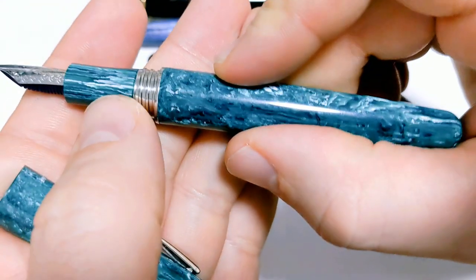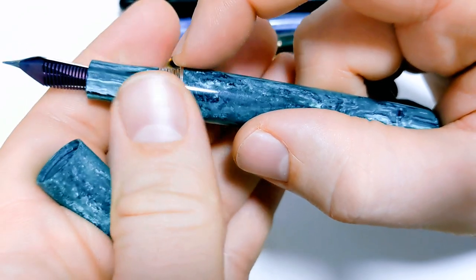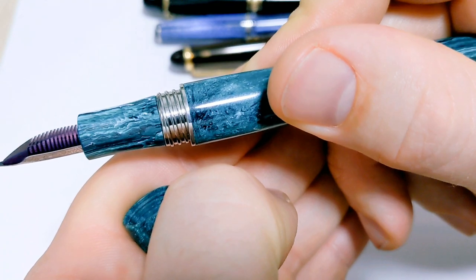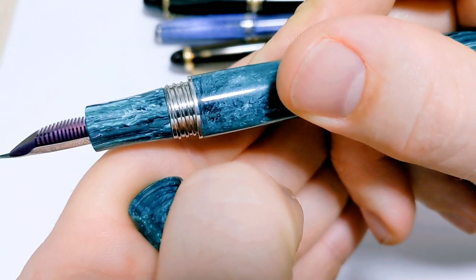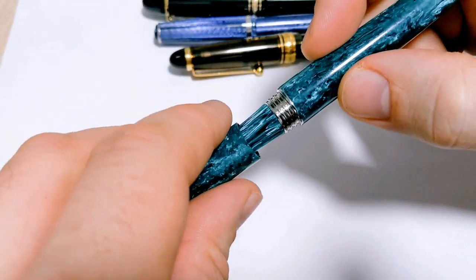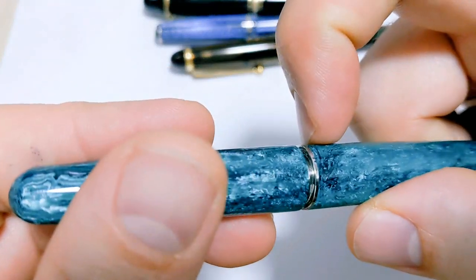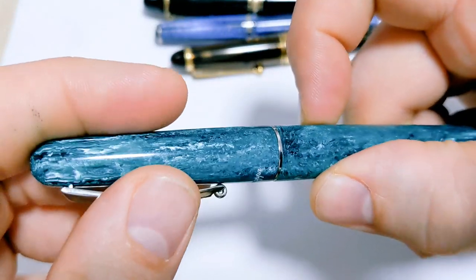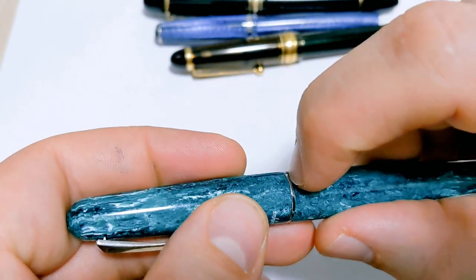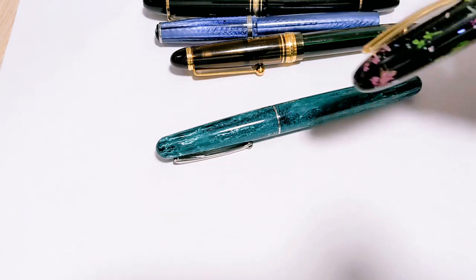It's a coarse thread. So typically coarse thread is sharp and pointy on the top, which would destroy this stuff, but they do a square thread. You can see that there. See, it's kind of flat on the tops. This is similar to something called a lead screw that's on some machinery. Whoops, I'm capping the pen looking through the camera. Very smooth, and also they have this collar. So when you close it, you stop. You can't keep driving the threads into the material. That's super important.